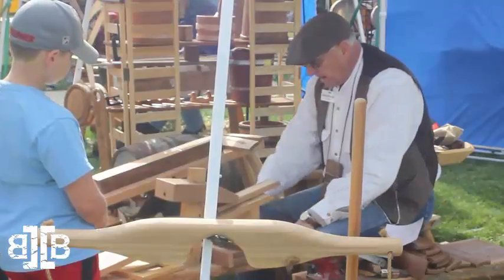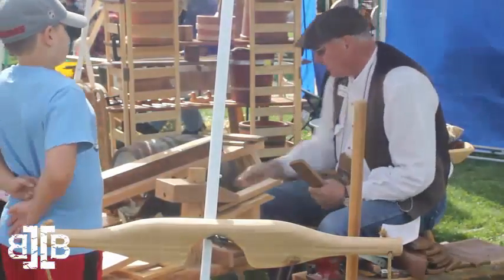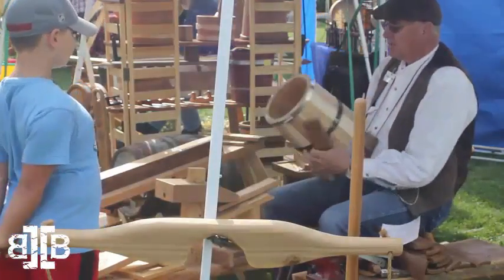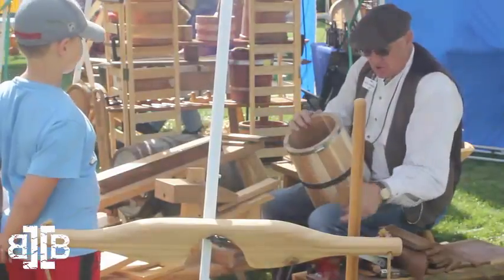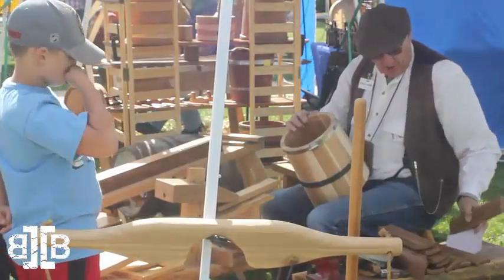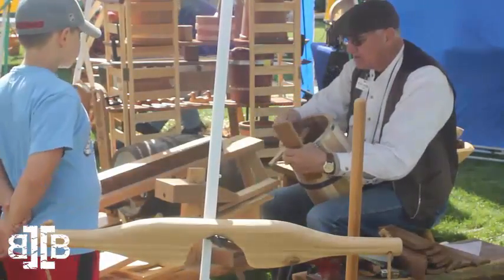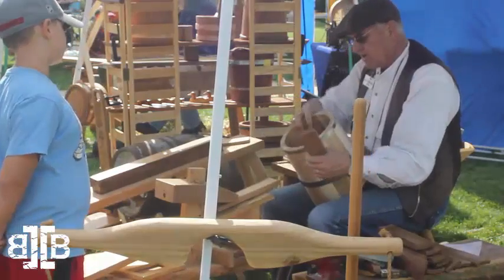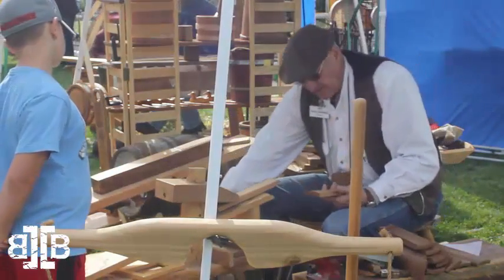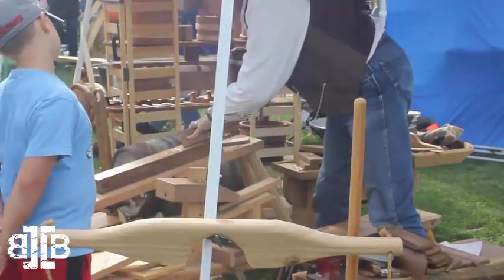So once I have it curved inside and outside like these are, then I have to put a bevel on it. You think of the bevel as pointing to the center. If all the bevels point to the center, like cutting a pizza, then they'll all come together around the circle and be watertight. So in order to get that bevel, I take it to my jointer plane